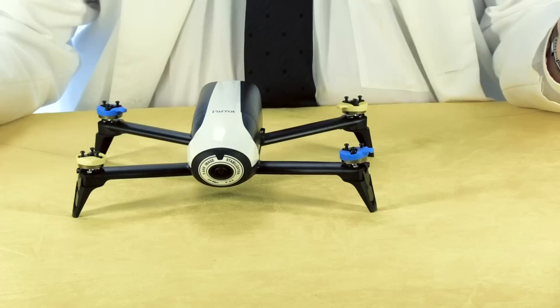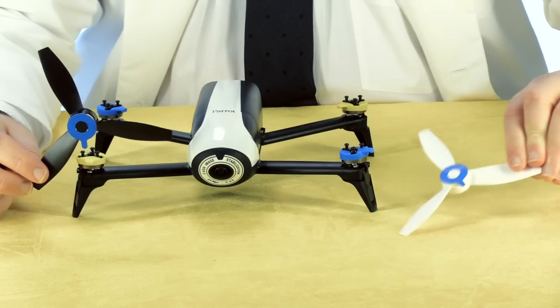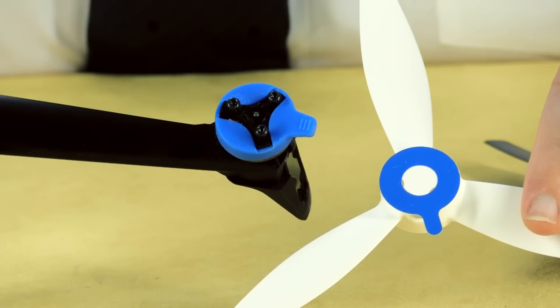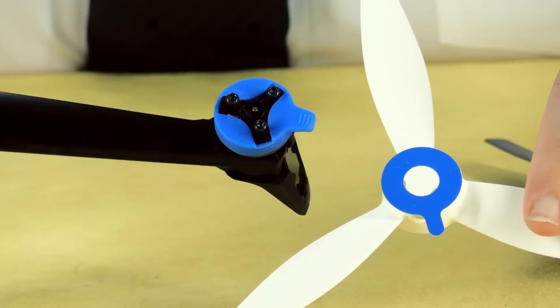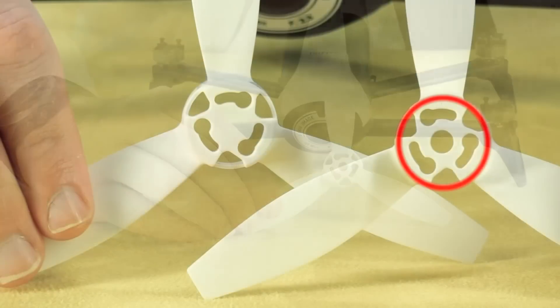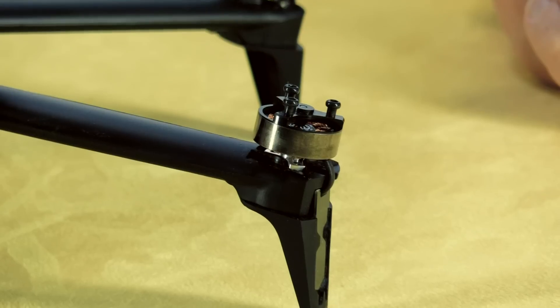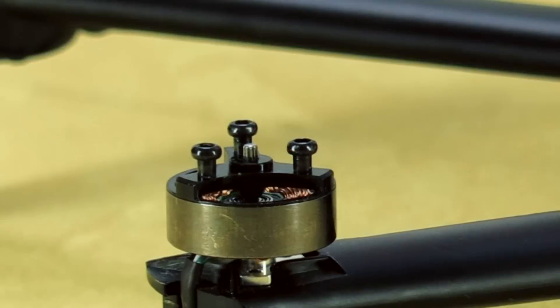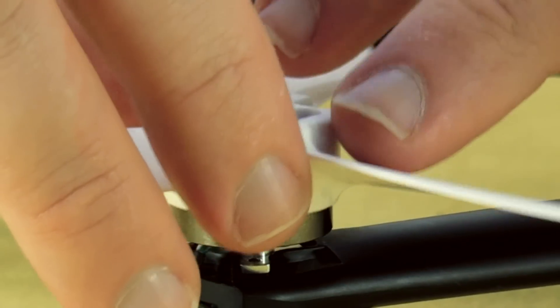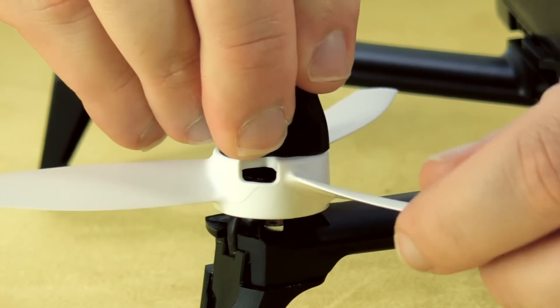The process of mounting the propellers is different than any other drone we've ever tested. The propellers come in two colors: white and black. Parrot intends for you to put the white ones on the front and the black ones on the back, but near as I can tell this is only so it looks cool. What matters is which way the propellers turn, and that's why both the motors and the propellers come with color-coded markers, making it easy to get right. Half the propellers have a hole in the center and those go on the motors with the little knob; the ones without the hole go on motors without the knob. To mount, line up the three holes on the propeller with the three screws on top of the motor, push down, then use the tool to hold the motor steady as you twist the propeller into place.